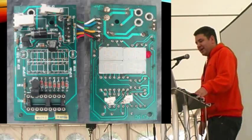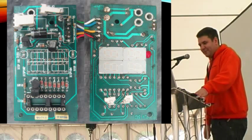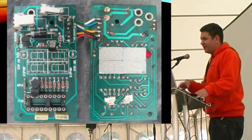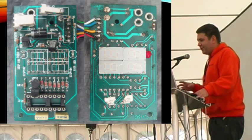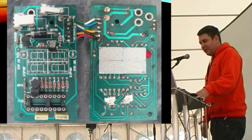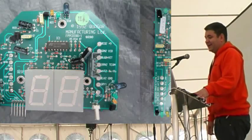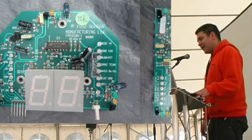Moving on to the display board - this is a rather horrible looking version of it because it's been a bit molested in its time. A lot of these boards are old ones. Basically what this does is it's connected over an SPI connection to the main processor to update the display. The processor does everything in hardware pretty much that it can do, including the infrared comms. The little LED on the right-hand side is just the charge LED - it shows if it's being charged or not. This is the front pack and the backpack: the front pack is on the left with the big flashy digits, and the backpack is on the right.